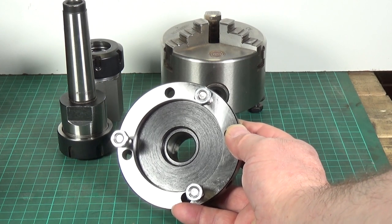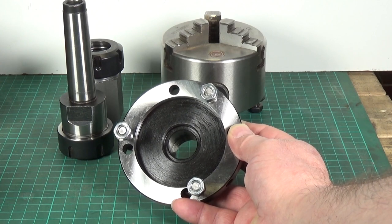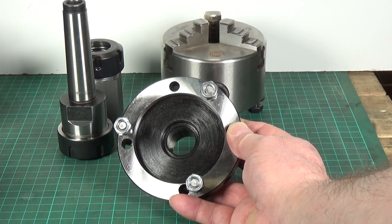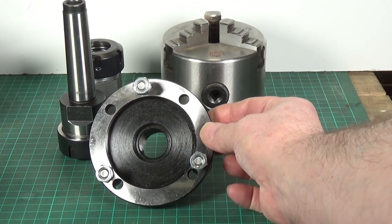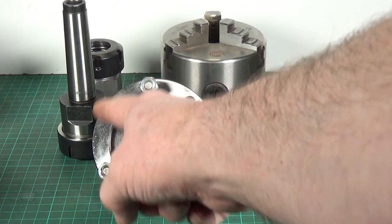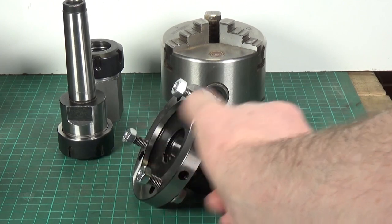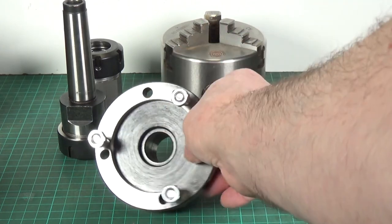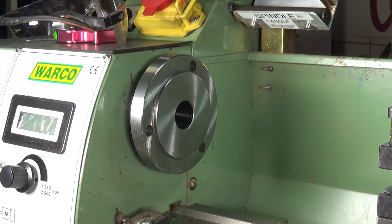They do now give you those dimensions, so after measuring up I realized that this one would probably fit on my Warco WM 180 lathe. It really only arrived a few days ago so I'm just now coming to fit it. As you can see it has four clearance holes and three threaded holes - those threaded holes are 8mm and they happen to line up with the headstock spindle plate on the Warco lathe perfectly, so I'll just swap the camera around so you can actually see that.